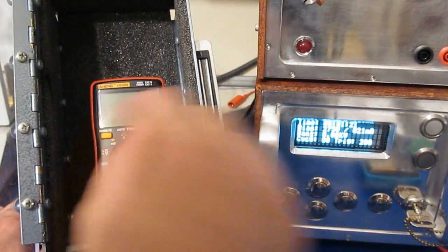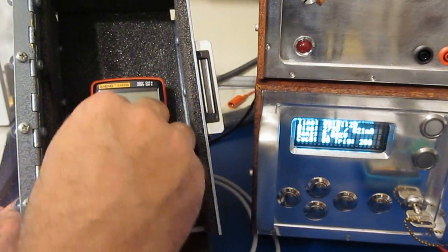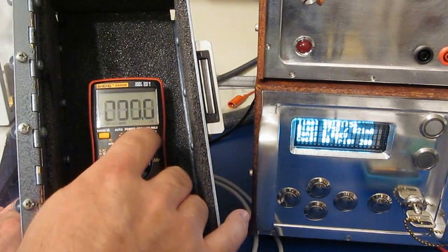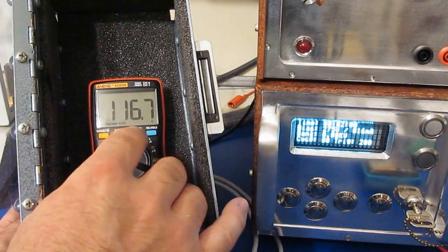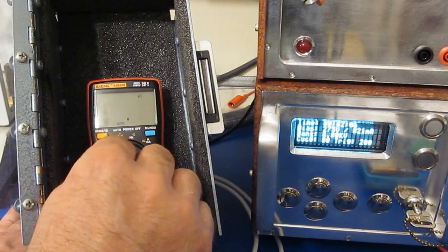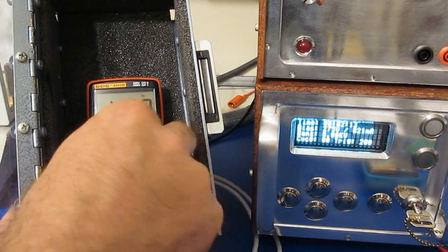So for this next test, we'll be switching the meter through all of its modes except for the current with a full rectified 220 volt AC waveform. You can see with it in the voltage mode, we're outputting roughly 235. That's pretty normal. And in the AC mode, there's our 116. So there's the millivolt range, resistance, and frequency. And again, I won't look at the milliamp ranges.